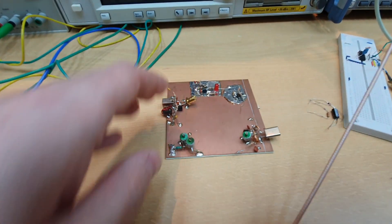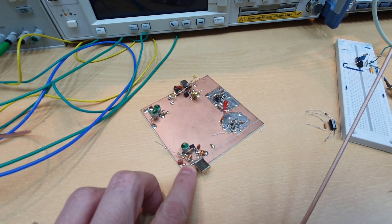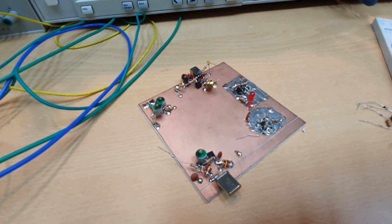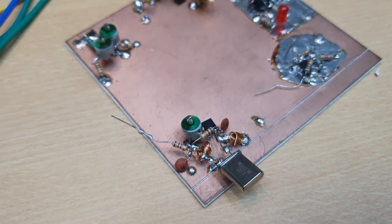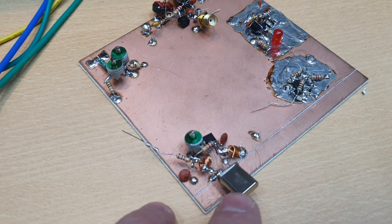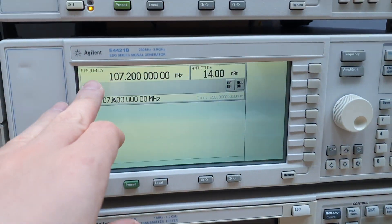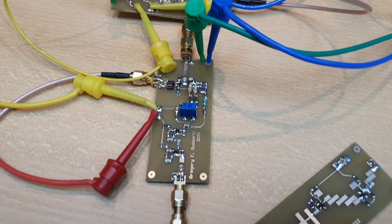I'm starting here to test the harmonic crystal oscillator — here's the prototype. I already showed this design on the channel; you can see the video about this overtone oscillator there. This circuit allows us to run a crystal in the fifth harmonic, so we are going to use a 21.45 MHz crystal to generate 107.2 megahertz, which is the input to the sampler.